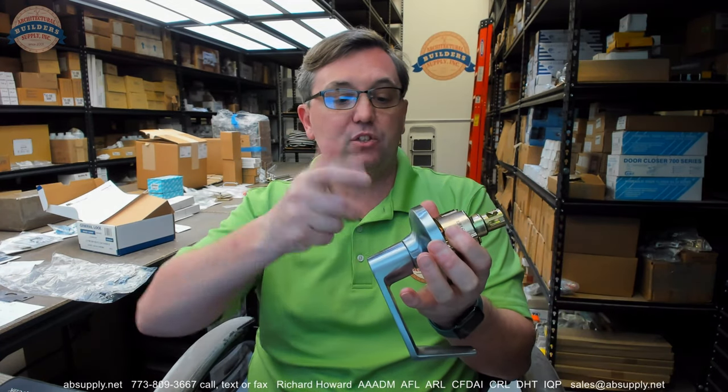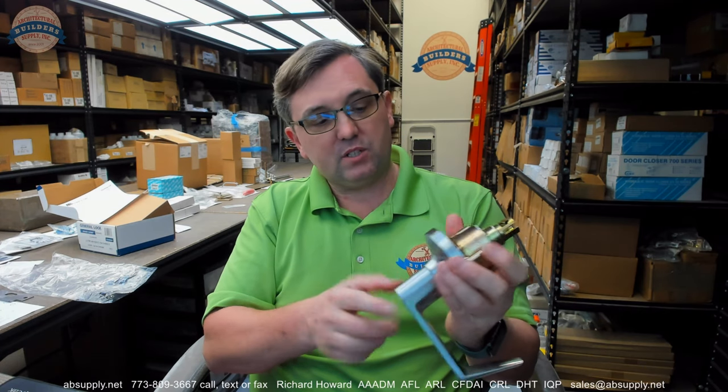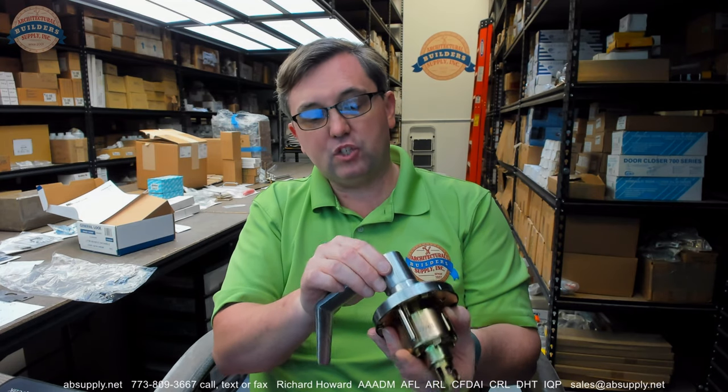As we look back at the installation instructions, that adjust door thickness section is definitely a reference to their grade 2 lock — for their grade 2 locks you would remove all the exterior material and then adjust accordingly. But not in the small format. There is no adjusting here that I can see. The trim on small format is not removable in general. We are going to just conclude that this operates the same as other small format trim. So we have looked at steps 5, 6, 7, 8, and 9 — we have completed the installation.